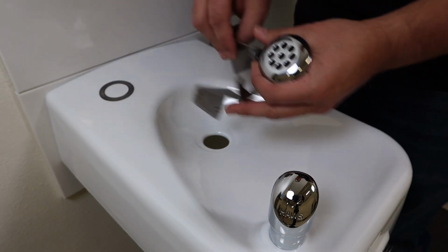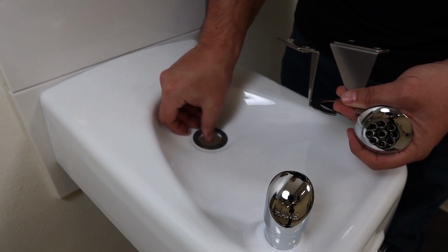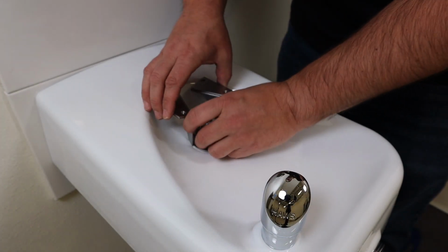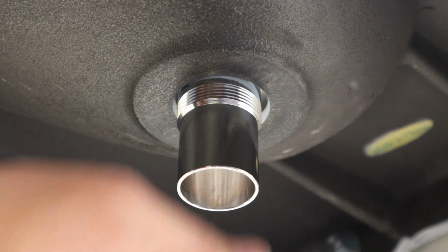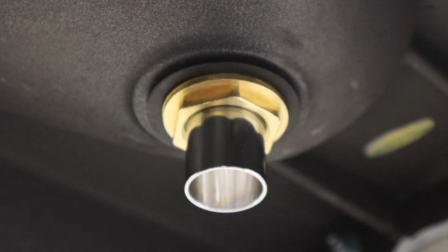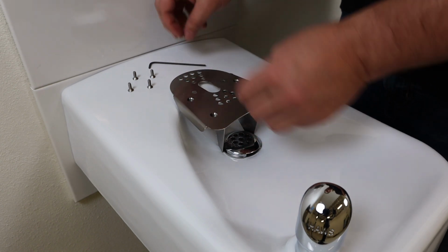Place the existing stainless drain washer over the drain opening first, followed by the bottle stand base as shown. Now, reinsert the strainer, rotating it so a drain opening faces the front. Reinstall the drain washers and the strainer nut, finger tight only for now. Install the bottle stand platform with the supplied flat screws, using the 3/32 inch hex key.